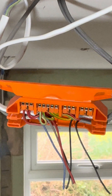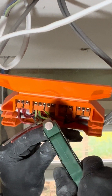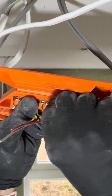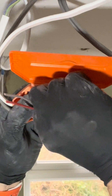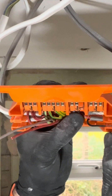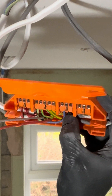So then now we want the neutrals. There's three of them — there we go — and straight into there. I'm bending them into shape because I just want to make sure that they fit into the box nice and neat, because you don't need a lot of excess in these. There's no point having it stretched out. So then we'll open the neutral up and get that in there. These are the neutral carry-ons — it'll be the neutral out to the light. Two neutrals, and then you're in and out on the circuit, and then you neutral out to the lights.